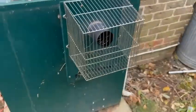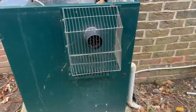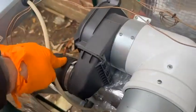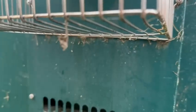Obviously your flue outlet there, that's correct. That's got a terminal guard on it, so anything that discharges less than 2 meters in height needs a terminal guard. It's just about okay for the window there. Really important on Worcesters. Okay, there's your air intake there, it sucks in here, but then it goes into here. Oh, you've got all these grills. You need to make sure all up here and all in here is all clear. If it's not, it will smoke. It is as simple as that. So if I stand back a bit, you can see them grills. They've got to be clean.